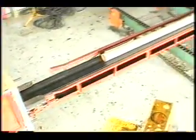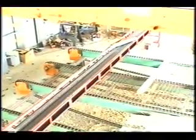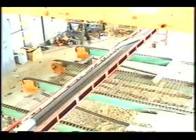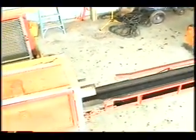Here you see the machine running 6 inch diameter dowels at 80 plus feet per minute. These 8 and a half foot dowels are running through the machine at the rate of approximately 6 to 7 seconds each. Larger diameters are slower and smaller diameters can be faster. The feed rate you use depends on the amount and type of stock removal and the desired finish.